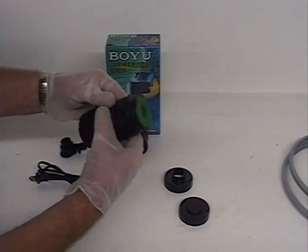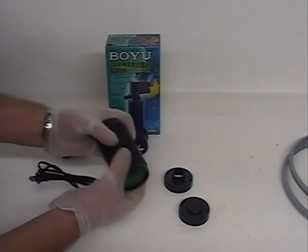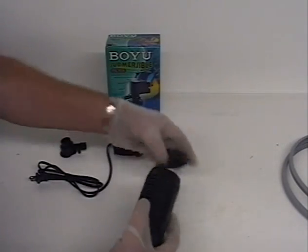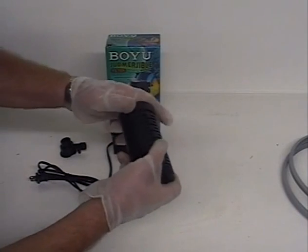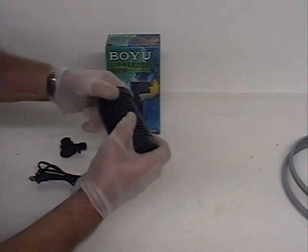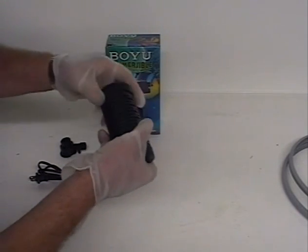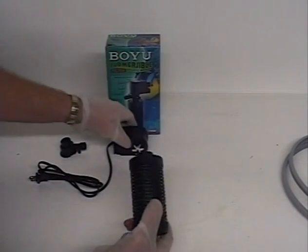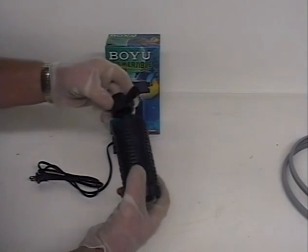Make sure you remove the pump from the solution every day. The pump does three jobs: filters the solution, keeps the solution temperature even, and agitates the part. To conserve space, you can remove the filter from the pump and just use the pump for agitation. You need to direct the pump outlet towards the workpiece.